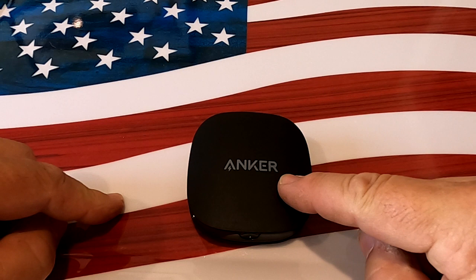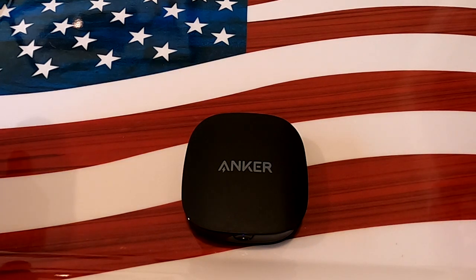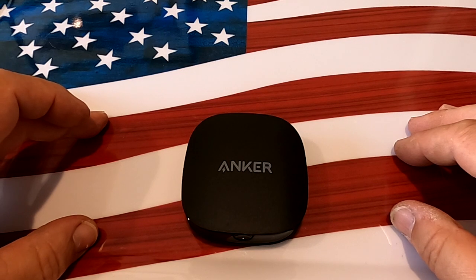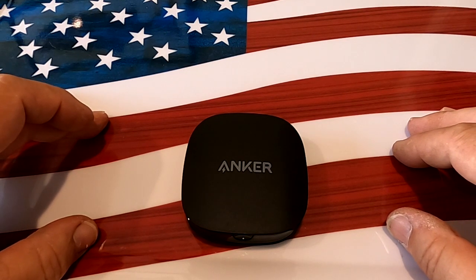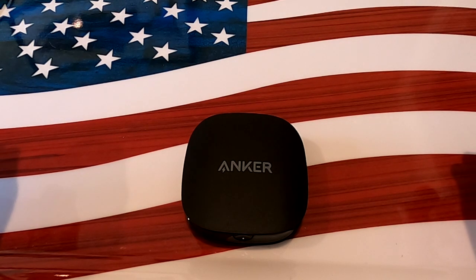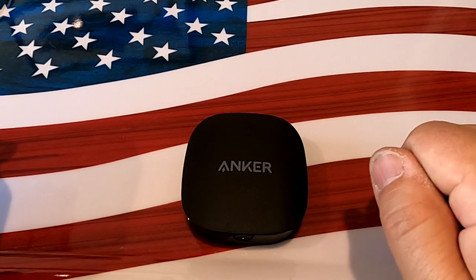The analog output of this is low — roughly half of what it should be. Any quality Bluetooth unit with an RCA analog audio output should deliver a preamp level of about 2 volts RMS. I'm guessing this unit puts out just over half that — maybe 1 to 1.5 volts. For new viewers, what that means is when you plug this into an AV receiver or vintage home stereo on an auxiliary input alongside a CD player, cassette player, or DVD/VCR — all of which give you approximately 2 volts — you have to crank your volume up quite a bit more to match those other sources.